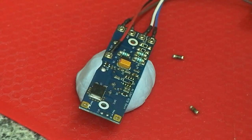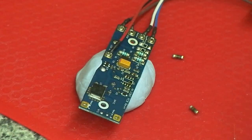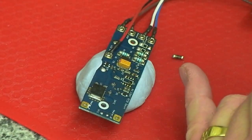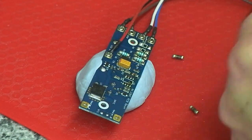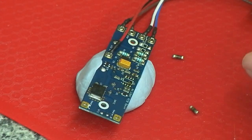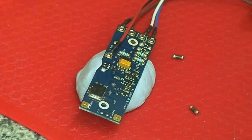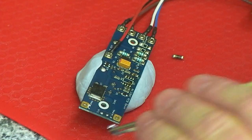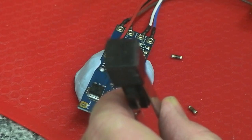I'm just going to risk the element so you can hear me. The good thing with doing it like this is normally I would flood the pins of the PIC with solder, heat up both sides with the iron, lift it off, then suck all the solder off, clean the pads, flux it - same with the MELFs on here. But with this method, most of the solder is left behind and you could in fact just reposition the IC and put it all back together, and the pins would take quite nicely.